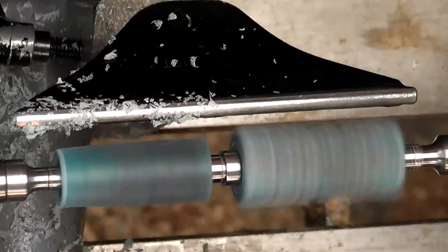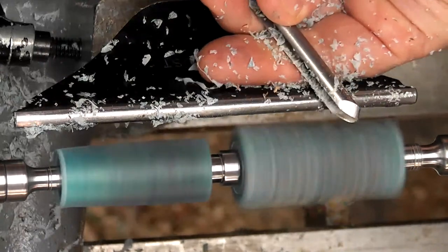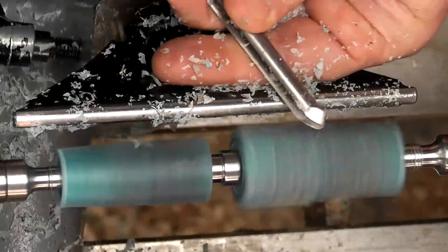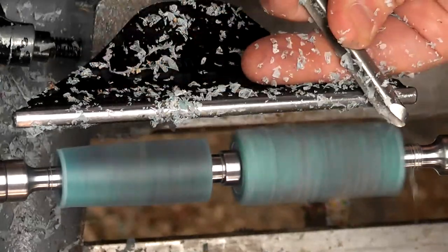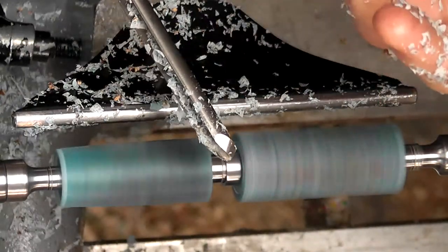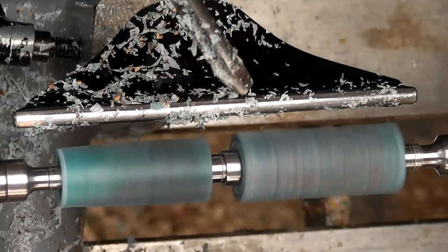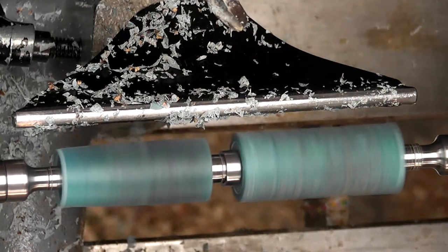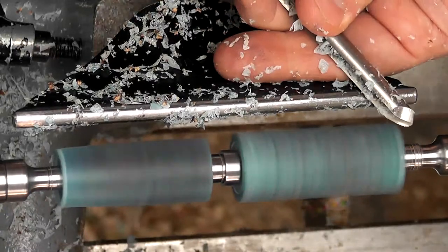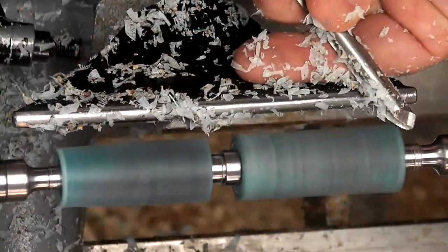One question that I know is going to be asked very, very soon is, did I use pressure or vacuum? So we need to talk about that as well. In this case, I used pressure. On the timber that we're going to use in a minute, the maple, that was stabilized using a very thin epoxy under vacuum. I've never done that. That's a pre-bought blank. So it's vacuumed to suck in all that epoxy and to get rid of all the air. But on these, this was pressure.